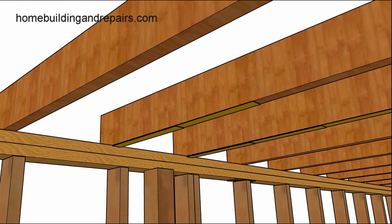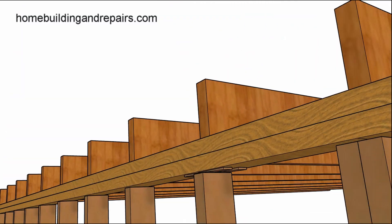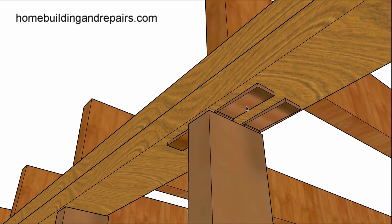Pan back out — there it is. You might need to put some shims underneath all of the framing studs that are raised and then toenail them. You probably can't use screws for something like that — you'd probably use some building hardware.